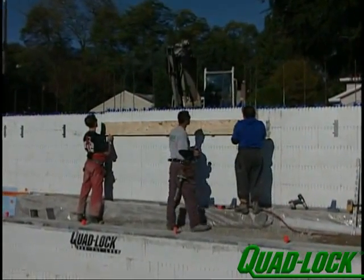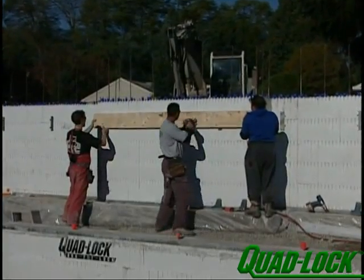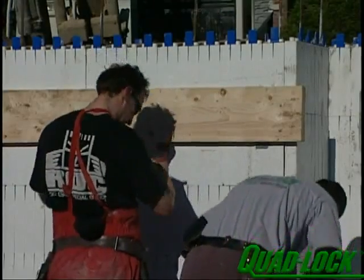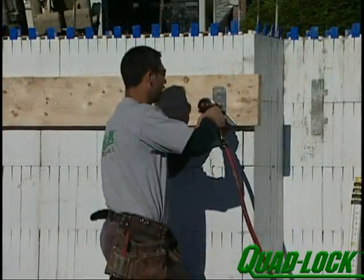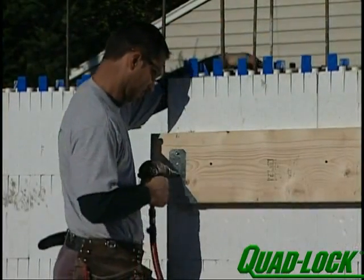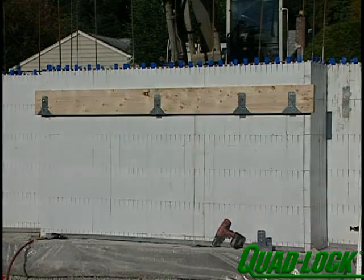Use the chalk line as a guide for elevation. You can use the tie flanges to temporarily tack the ledger in place while fastening. Transfer that layout pattern to the ledger material and fasten the J-shaped portion of the bracket to the ledger board. Fasten the assembled ledger to the fixed brackets using self-tapping screws provided. Ledger brackets can also be used for attachment of interior walls. If using alternate means of ledger construction, consult the QuadLock product manual.